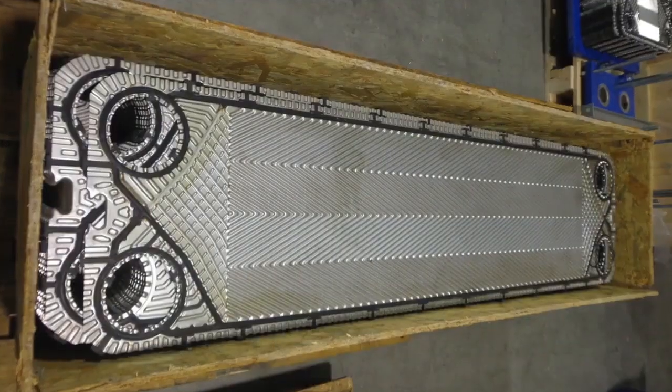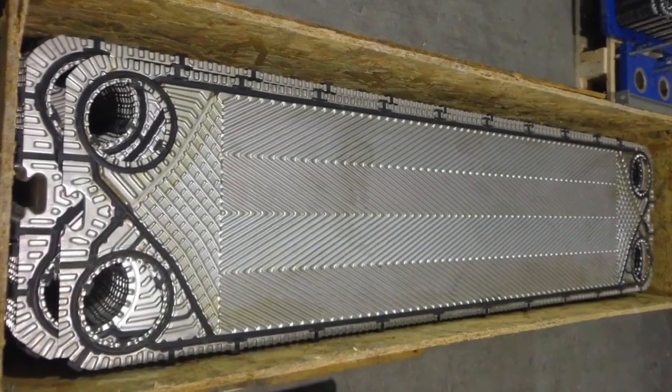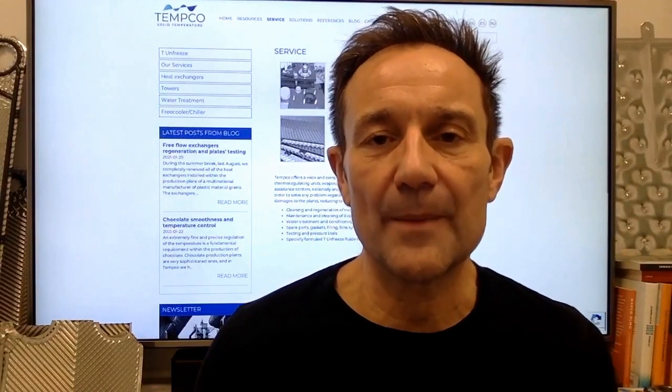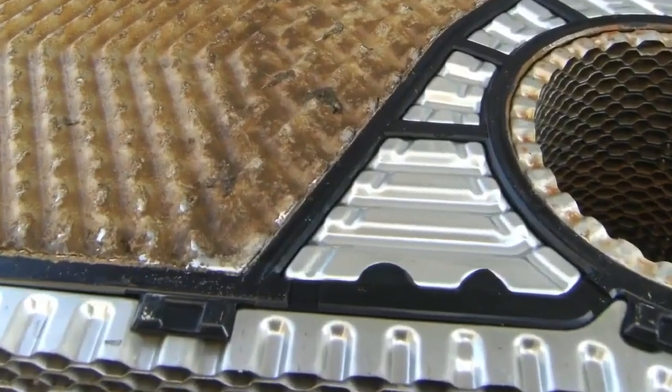Different is the case if it is an exchanger that, after 2, 3, 4 years of operation with cold water from a cooling tower, maybe at 30 degrees, or from a refrigeration unit, presents dirty plates. I wash the plates. But when I disassemble it, I realize that maybe the gaskets are still like new. Consequently, especially when we talk about clip gaskets, so without glue, it is very likely that I can recover them and reuse them. Then, honestly, common sense also in these operations.